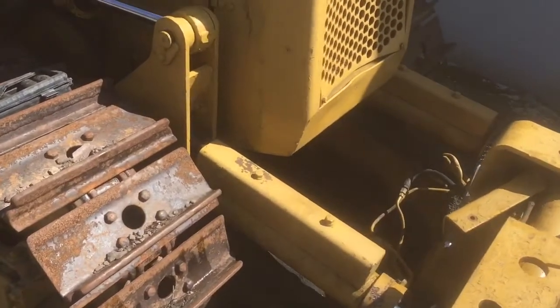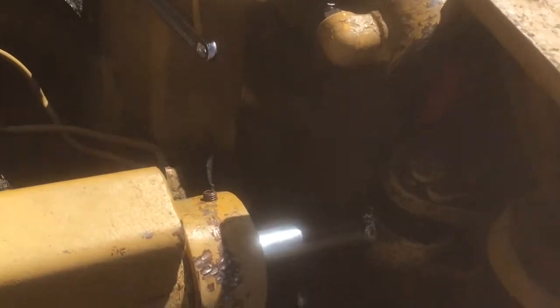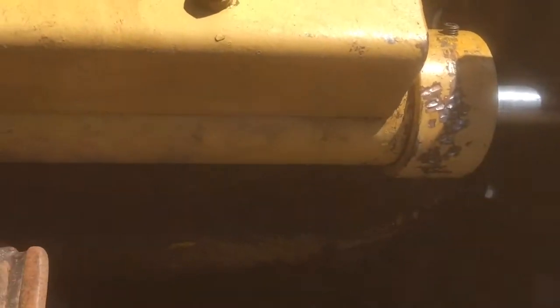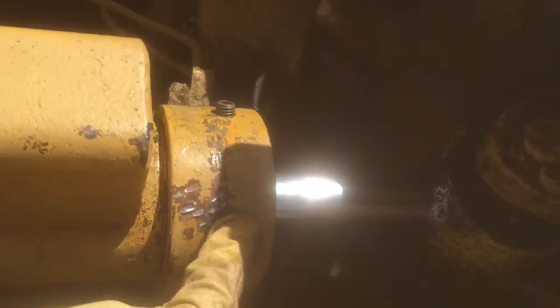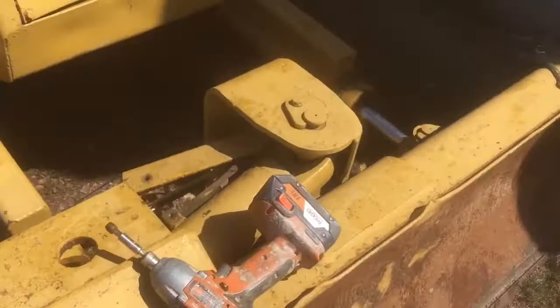And looking at the other ones that I did here recently, I had to hammer those as well to initially get them loose. And they caused a little bit of external damage, but these caps are about a 1/2 inch thick steel, and it really doesn't cause any internal damage to the threads or anything, so it's just a little cosmetic damage, but nothing really to worry about.